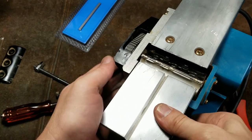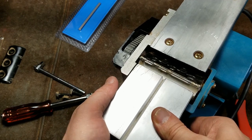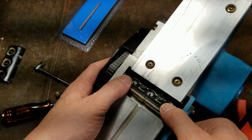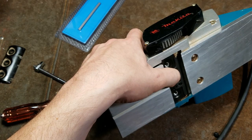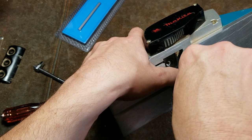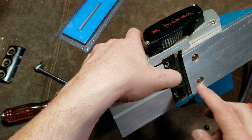Many times people have issues with the accuracy of the zero mark. They're like, it's cutting when it's at zero, or it's not doing what it's supposed to. Oftentimes you just need to adjust the blade height. I did want to point out that when you're adjusting the blades, it's not a lot of torque. These screws actually don't go in that far.